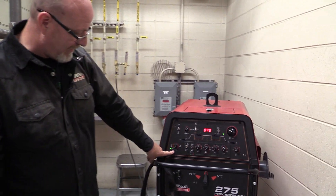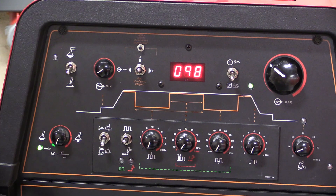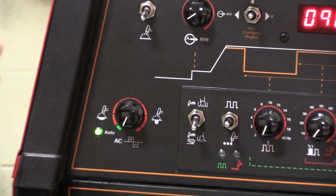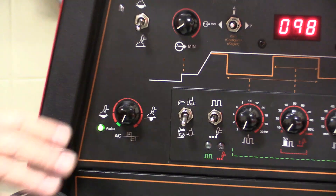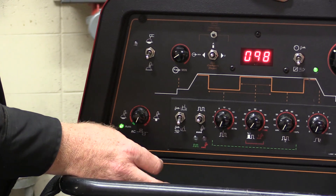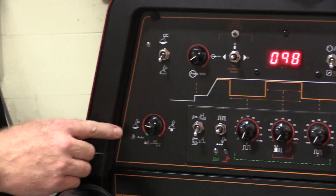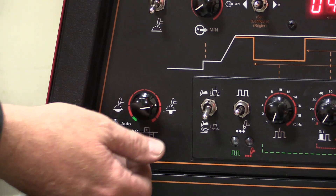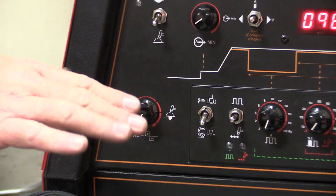If we look at this now, over here on this control, it says alternating current — AC — and the light is on. So what this dial does is if you set it in the green, the machine balances the sine wave. It balances the amount of DC positive polarity and DC negative polarity, and that's about a 50-50 balance. If we're welding aluminum that's a little bit older and we need a little more cleaning action, then we can turn the dial a little bit more towards cleaning, or we can turn it a little bit more towards penetration. But for now, the best place to start with this is AC and auto — that's about a 50-50 balance.